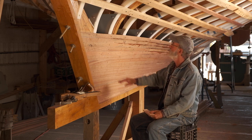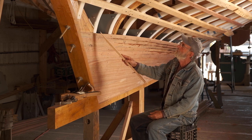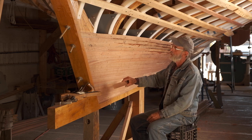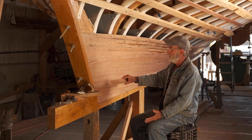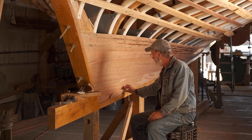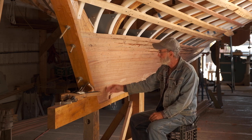This stuff is progressively bevel sawed. You can see the bevels right here written on the frames — 2.5, 2.5. We're going to pick those up and put them on the strip, then cut the strip in the table saw to progressive bevel. And obviously you can see that we have room in the rabbet here for the next layer of planking, which is going to go on.